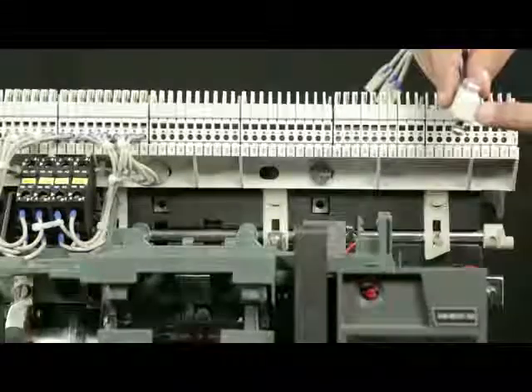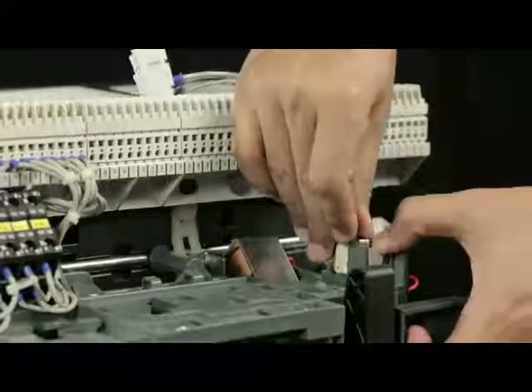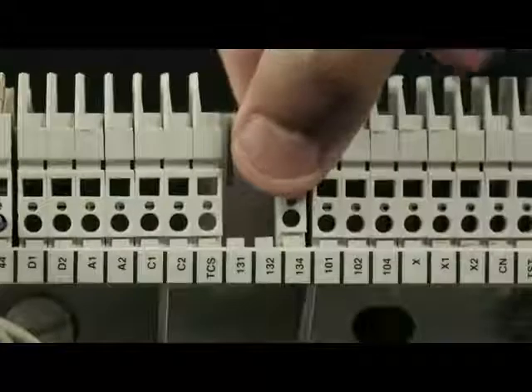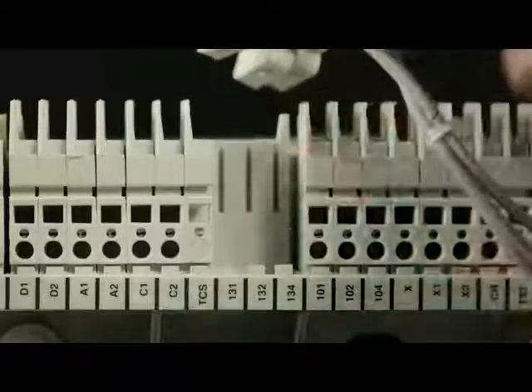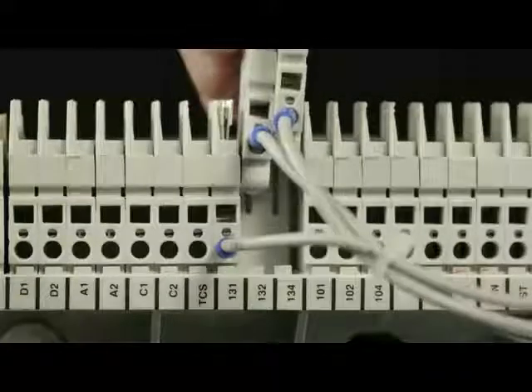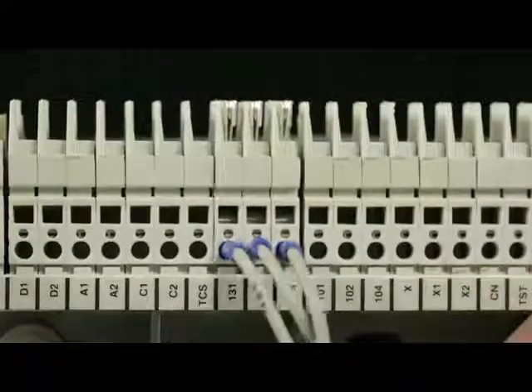Pull down the charging handle halfway and take out the fascia by tilting it upwards. The microswitch needs to be fixed in this slot. Click fit the microswitch in the top plate. Remove dummy SICs from 131, 132, and 134, and click fit the microswitch SICs with appropriate wire number at this position.